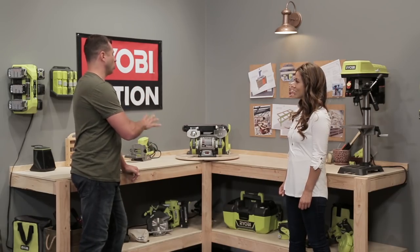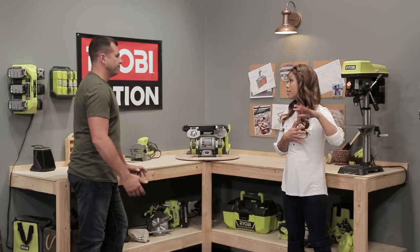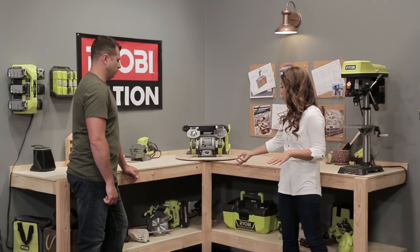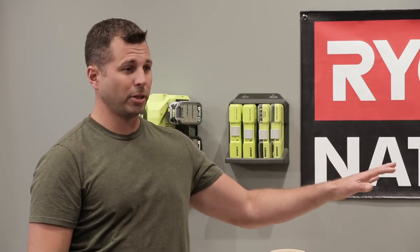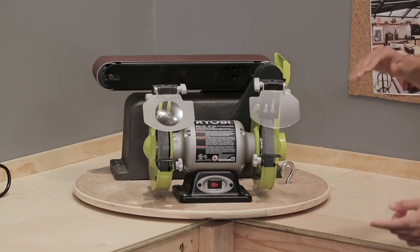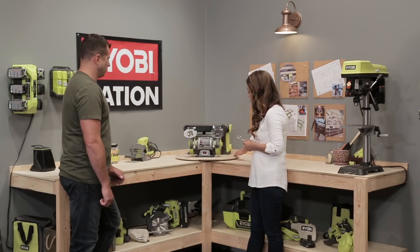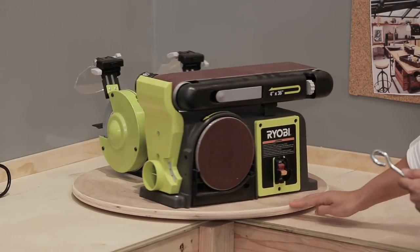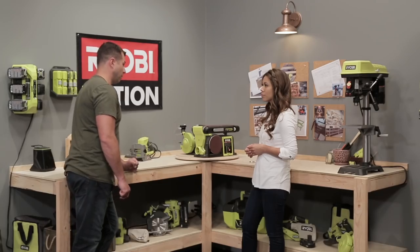No workshop's complete without a solid work table, and I love that we built a corner work table in our shop. These use the same building techniques as the built-in shelves — a nice shelf so you can store your tools, but you can modify it however you like. One issue with a corner in a shop is you end up just piling stuff in there — it becomes the corner nobody wants to go to. All we did here was take a piece of plywood, cut it in a circular shape, and mount lazy susan hardware to the bottom. When you need to use your bench sander, just pull the pin, easily rotate it, and pin it back in. It's a great use of space, and it's a must-build for sure.